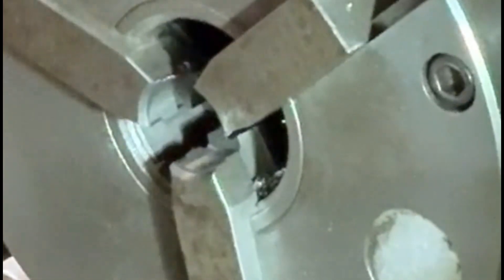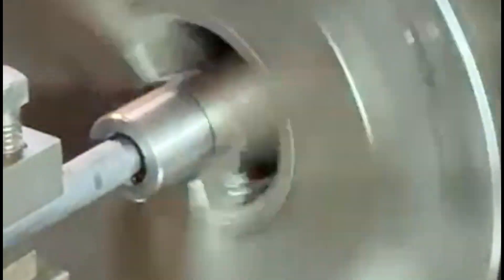I'll put another one in just to make sure everything's okay and run another one through. I've speeded this section up a little bit just so you can see the procedure without getting bored — it's boring in two ways: it's a boring operation, and it's also slightly boring because it's taking a long time. Anyway, that's looking good — it's come out to the right diameter and it'll be adequate for what it's meant for.